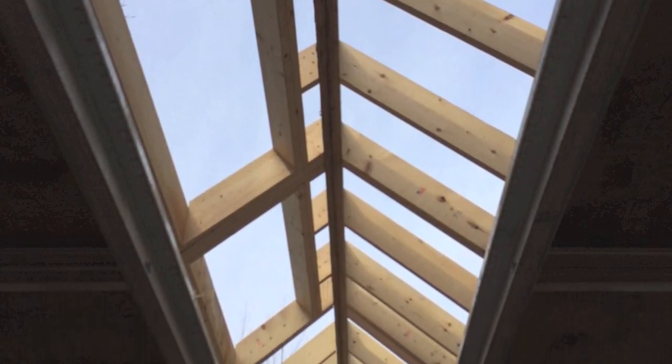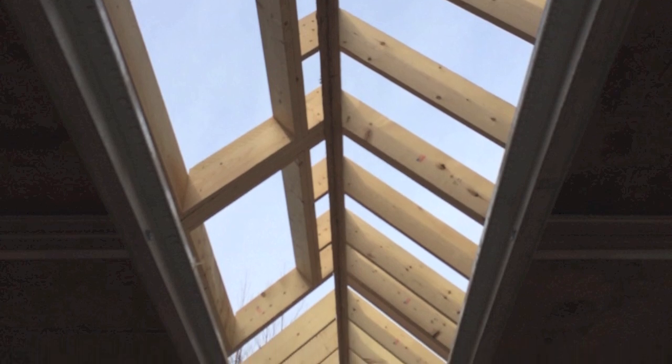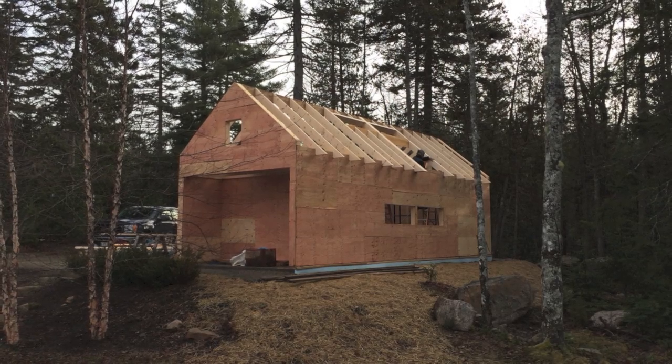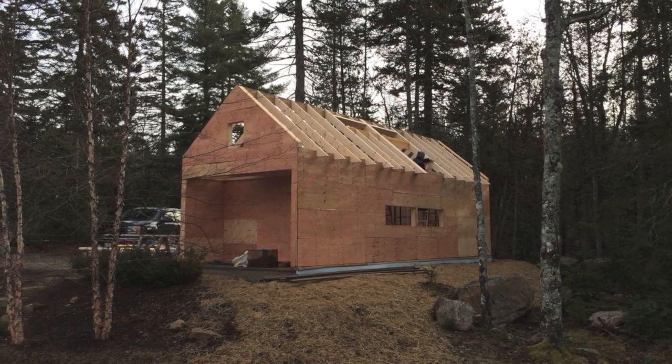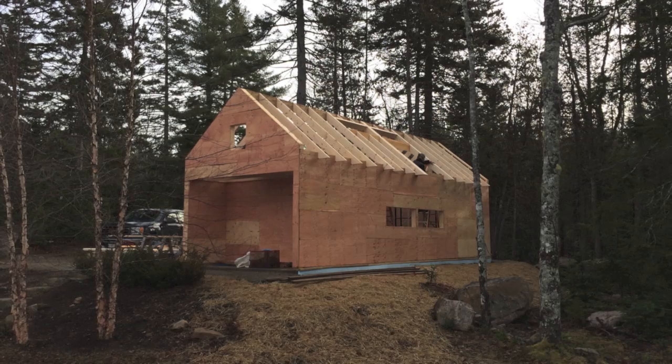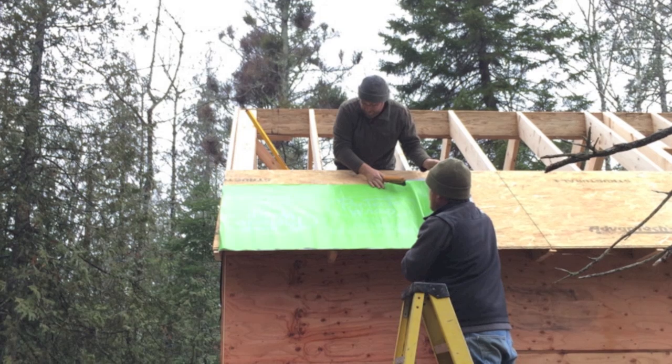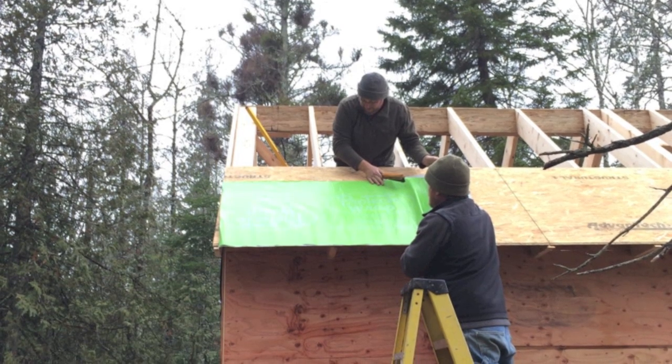You can see the framing for the skylights — we've cut the vertical leg down so it lets more light in. You're looking at them setting the last few rafters in place before they begin adding the roof sheathing. On top of the roof sheathing we're going to place our engineered felt membrane. For the walls, we're using a 30-pound roofing felt, which is a heavy-duty roofing felt.